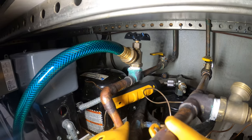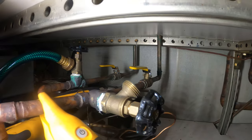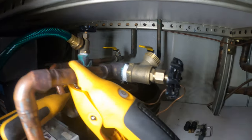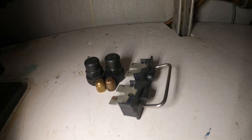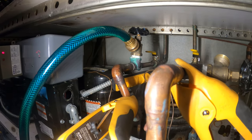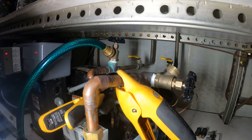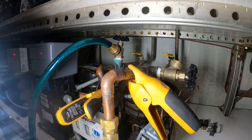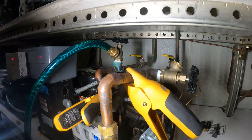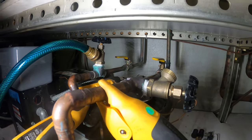We've got a garden hose on the hot side and a bucket ready. Power is off — there was a pull switch so the unit is unplugged. We're not moving water, and for a water-cooled system with high head pressure, that's our clue. Just like high head pressure on an air-cooled system means we're not moving air, here it means we're not moving water.